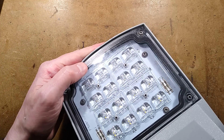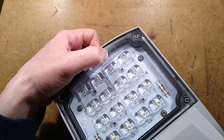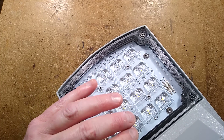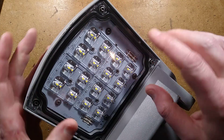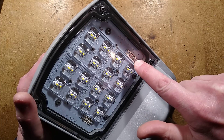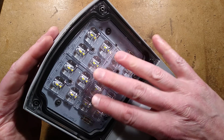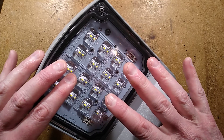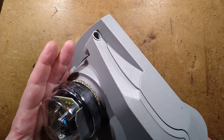The circuit board they've got inside — ASD Lighting, it says — says Osram Oslon. That is the type of LEDs they've used in this, which is a premium LED. We've got the two power connections and we've got an NTC thermistor connection, and there's the thermistor there just for monitoring the temperature in the head. Although in this particular light it's not used because it's quite low power — it's only about 25-ish watts.